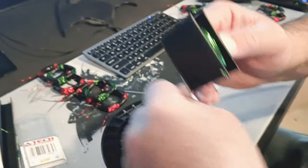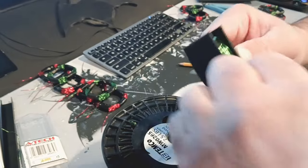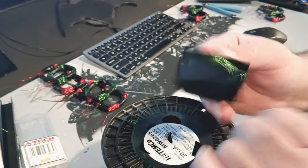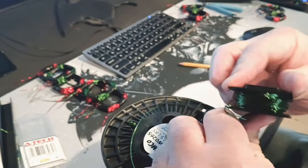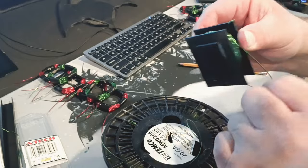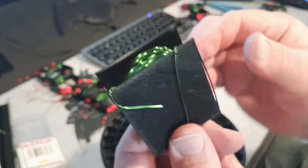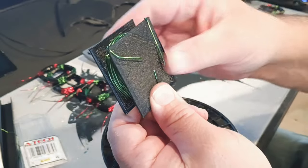We got a little bit more to go on this one. What I did on this is I put two different colors on the wire so you can see them when we're done — it looks better. Tighten it back up, turn it over. We're just about done — a couple more wraps and this thing is good to go. Again, just make sure you don't hook up any corners here and you should be good to go. Now when you have it that way, you bend it back over the side — that makes it stay there. Go ahead and take your little nippers here and cut it off. Now you got your coil.